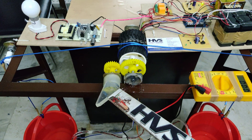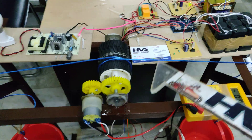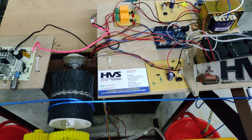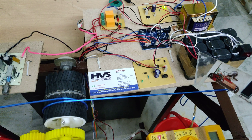Though we are generating DC, when the system rotates clockwise and counterclockwise the polarity will change. So in order to maintain the same polarity we are going to use a bridge rectifier. After that we will get pure DC with polarity correction, and then the battery will get charged from this generator voltage.